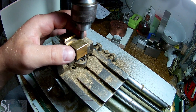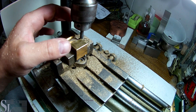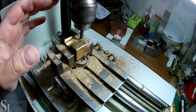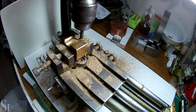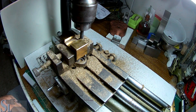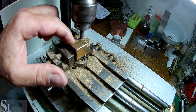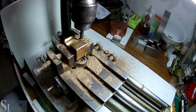This cutter is cutting really well — I can feel it's still razor sharp, no dull sections whatsoever. Cuts really, really well, and it's pretty amazing considering the price. It's made in China, but it's really nice work. This is actually the first time I'm cutting with a Woodruff key cutter. We need to raise it by 1mm, but before we do, I want to lower it by 0.1mm and just do the bottom properly. The first cut I didn't want too many contact surfaces with the bottom and the side, so we cut just raised by 0.1mm. Now I do want to touch the bottom, ever so lightly — I'm not going to apply any pressure whatsoever, I just want to hit the bottom.